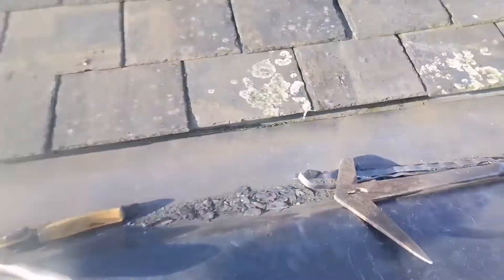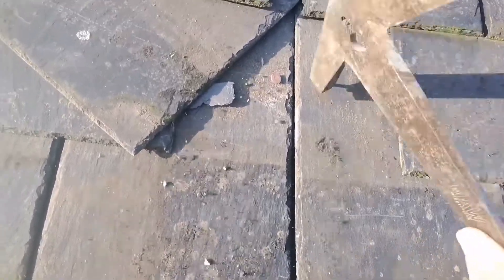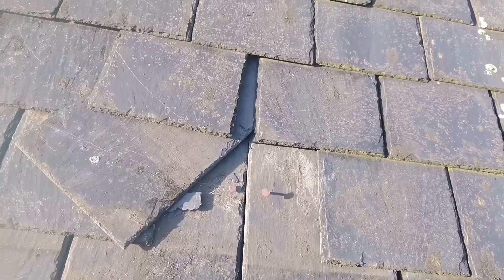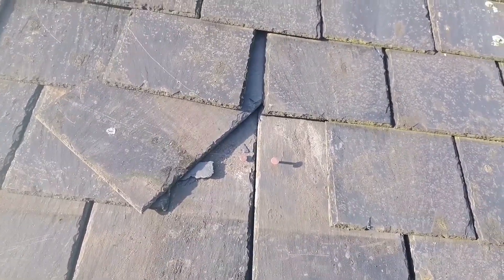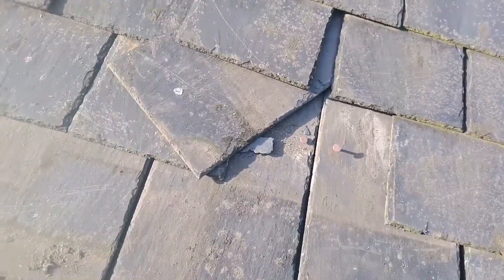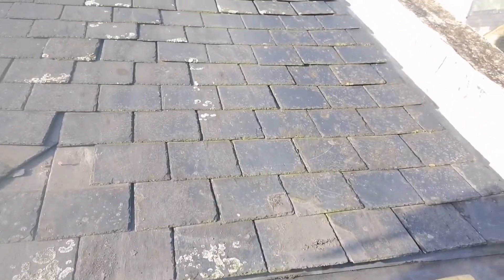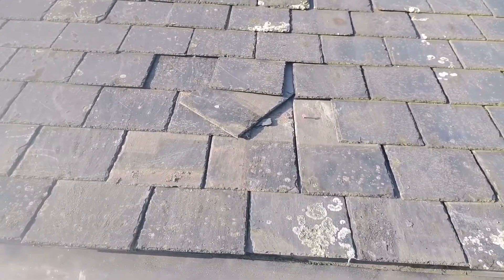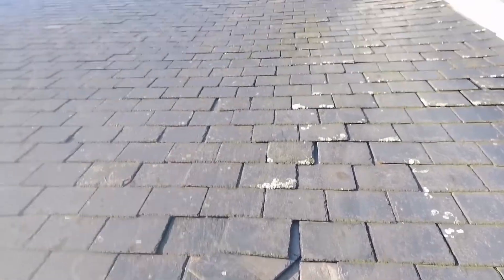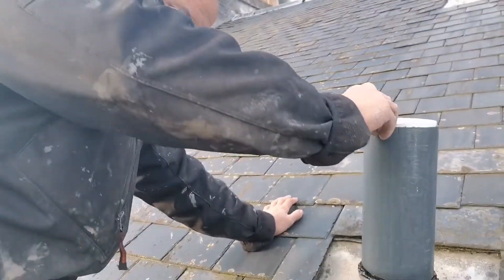Right, I'm trying to put all these slates back in on the gutter. But we're realising that as we're going through — I'm just going to tap the roof and you should be able to hear — this is a boarded roof, a sarking roof. When they redone the roof the first time they didn't re-nail the sarking boards, so you've got a roof laid on top of rafters held on with nails that are over 120 years old and obviously gone. I've got to go back to the customer and explain that I'm really struggling to nail their slates on. This is not going to be fun.